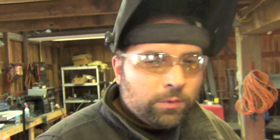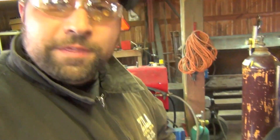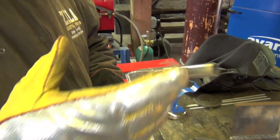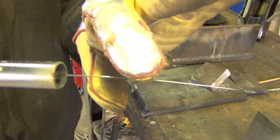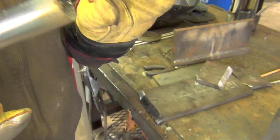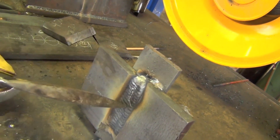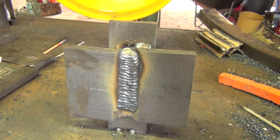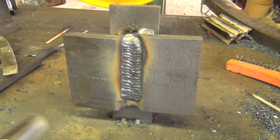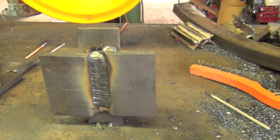So what happened when the wire wasn't feeding correctly and you saw it burning back more? One of two things: either my contact tip to work distance was too short and everything heated up causing the wire to bind in the tip, or the drive rollers were slipping. We're using V-groove drive rollers here — we should use knurled drive rollers with a little bit of tread that feed the wire nicer. This tubular wire, besides being really slick, is also really brittle — you can break it off without side cutters to restart. Now let's see what this looks like. It's a ginormous flux core weld. This is about the widest you can go — from here you have to put half passes in. Legally, you're only allowed to go so wide.